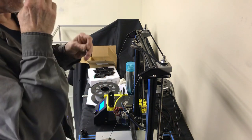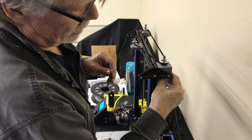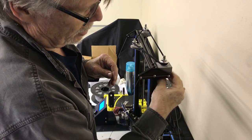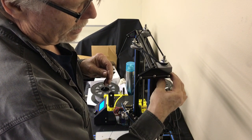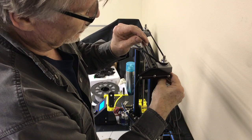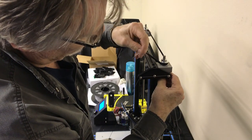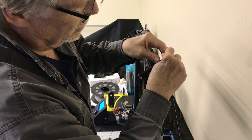our Allen screw. I'm going to explain this first so you know what I'm doing. The set collar underneath here has a little set screw that comes out of it. There's two set screws on this, or grub screws. You want to have that so your fingers aren't slipping on the collar down here. You want to actually feel that grub screw on there. That's going to be kind of your handle, your traction on it. And we know that if we look at these threads, we can kind of see what direction we have to go. I'm going to loosen this one first.